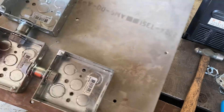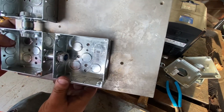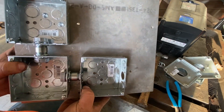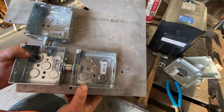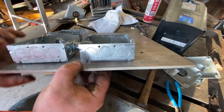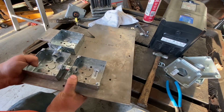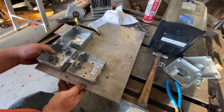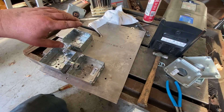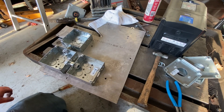We have them screwed into position. I'm going to take the screws back out because I have more work to do and don't want metal shavings in there. Quarter-20 is well beyond overkill for this — especially with five of them — but that's what I had, and they'll make good places for hooking grounds too. They are just a hair proud right now, but when I do all the grinding to fix this edge, I'll knock everything flat. So that's the bulk of it actually done. Next time we'll put the VFD over here — it takes different sized bolts so I need to get some — and then we'll start wiring it. Awesome progress. This is Adam from Small Town Machine Shop — please comment, like, and subscribe, and thanks for watching.